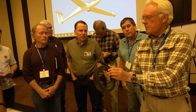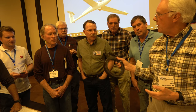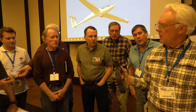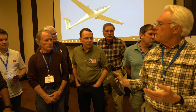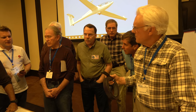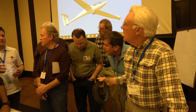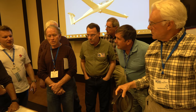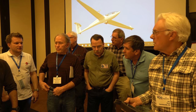Here's a broken belt — that's how they break catastrophically. The DG maintenance manual says replace the belt every 50 hours. I talked to DG 10 years ago and they said it's because when they did their certification, the prototype only had 50 hours on it. You have to conduct a test run of at least 50 hours to get the whole power system approved, so all parts used during those 50 hours also get that 50-hour lifetime.